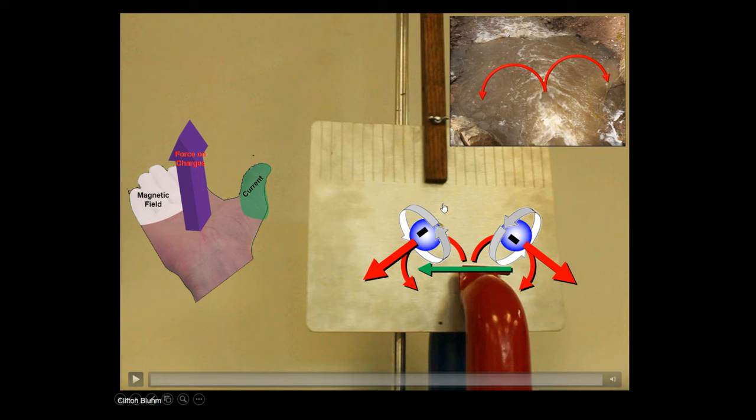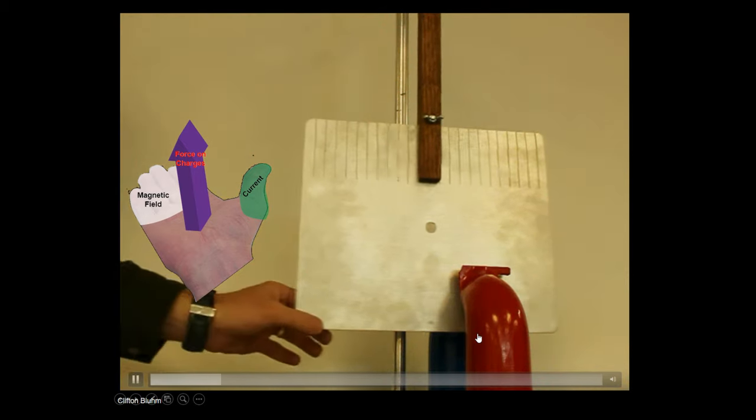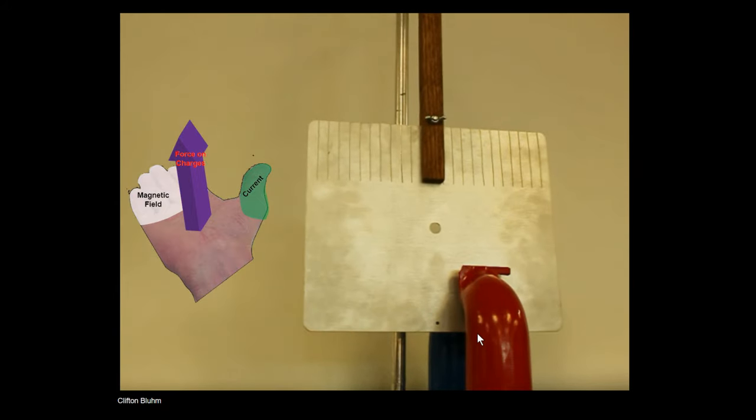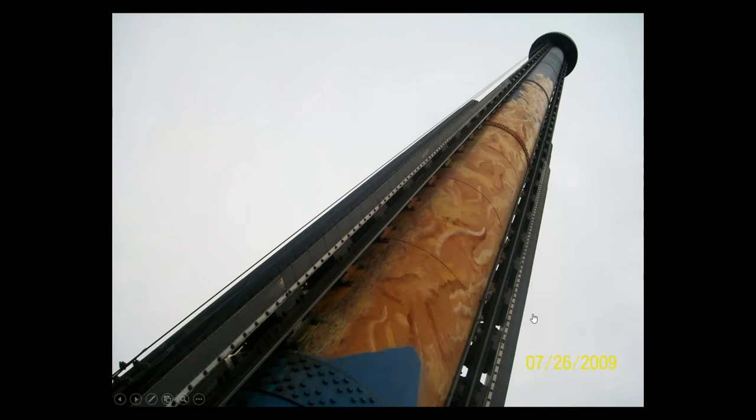But if they're moving, they have a magnetic field. And the magnetic field of those charges is going to interact and oppose the magnetic field that got it moving in the first place. And it's going to slow that thing down super slow, and it creates a dampening force that stops it. If we flip that thing around and have these little slits cut through there, it didn't do it, because the electrons couldn't jump across that slit, so they couldn't get moving in the first place.